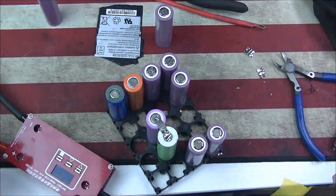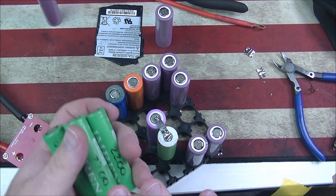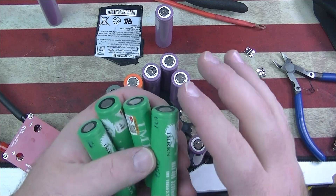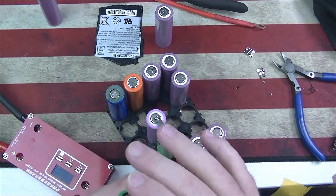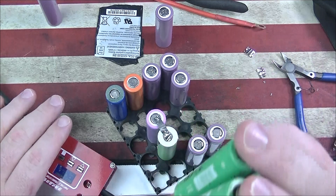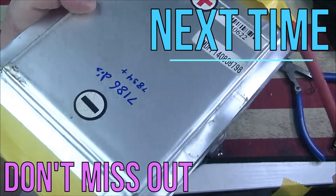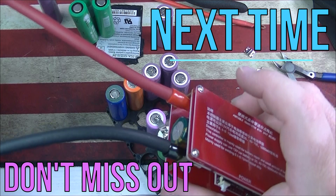Let's take these regular 2200mAh batteries and make our own 12-volt battery out of batteries you wouldn't normally use to power the welder. These are probably 5 amps draw at best, so I'll put them in series to make a 3S battery — maybe 15 amps — and see if having incompatible batteries to run your welder will still give you enough amp draw to spot weld. Definitely a battery with a 200-amp rating will power the spot welder; now let's see if using an inadequate battery makes any difference.